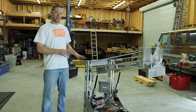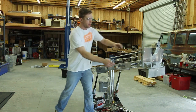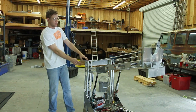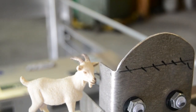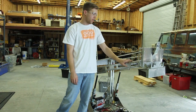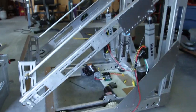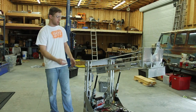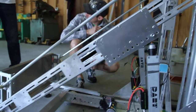I work primarily on the four-bar linkage. A four-bar linkage is four bars: a ground link, a link here, and two long lines. It allows you to keep the front mechanism parallel or perpendicular to the floor. It's basically a big trapezoid — as you move one link, the other links will move with it. We use Modulox rail to frame out the sides, and just a simple threaded rod end with a long tube that we tapped to create the top link. The bottom link carries all your force, and the top link just constrains the whole thing.